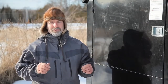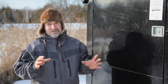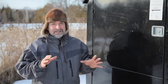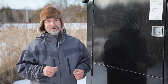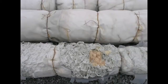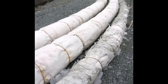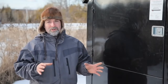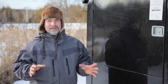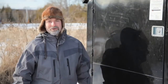Then there's the hidden issue of groundwater. Whatever pipe system you choose, it's got to remain free of water saturation during soggy times of the year, because if the insulation gets wet, it's not going to insulate anymore. This is where every homemade pipe insulation strategy that I've seen fails. Insulation gets compressed and waterlogged and offers very little resistance to the loss of heat to the surrounding soil.